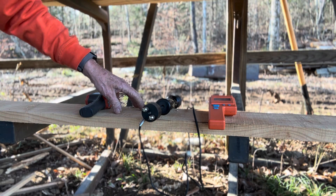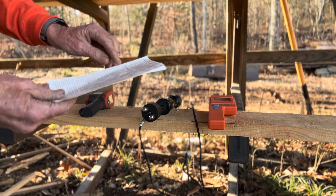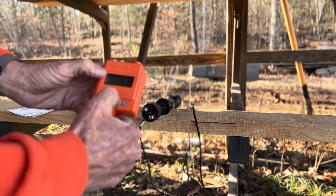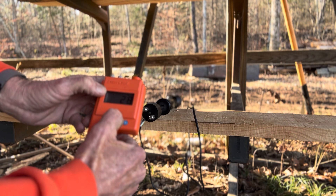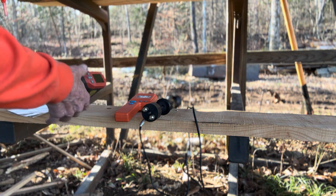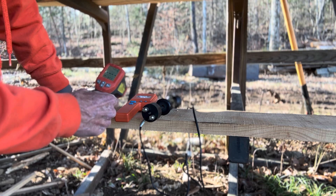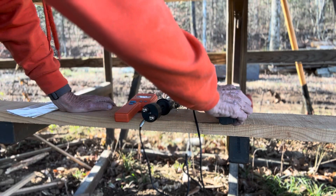The first thing we want to do is make sure you know your species of wood. This is maple, so we get our trusty chart out and we see that hard and soft maple is number 29. So we take our meter and run it over to 29 — we're about halfway home and it doesn't take long. The next thing, now that we're set with our species, is we're going to check the temperature of our wood. Remember, we bring these out of the kiln — this wood can be 140 degrees. It makes a difference in the reading versus the heat. So checking with the heat gun: 55 degrees, 52 degrees. As you can see, it's not warm, so we don't need to worry about that.